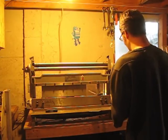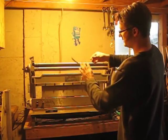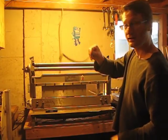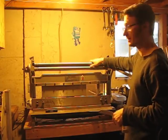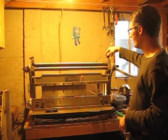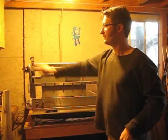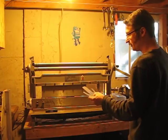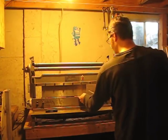I'm just going to eyeball it with this. And finally, I have a roller, which is actually how I arced this piece here. You just crank it through these rollers, and you can put a bend at whatever angle you may want. You can adjust this to get whatever arc you want. I'm going to put these bends in now.